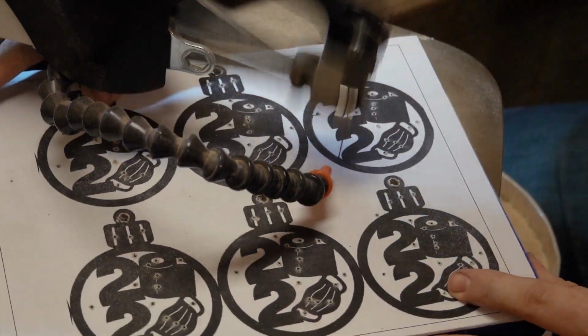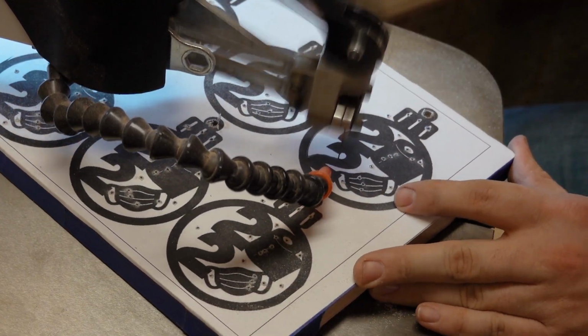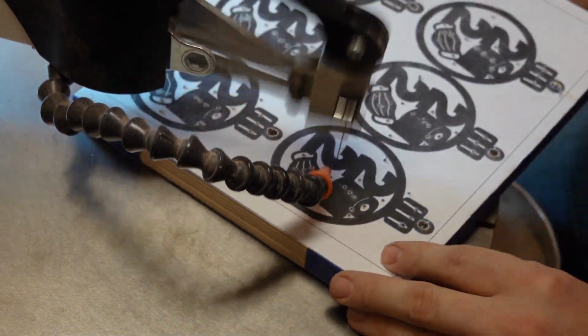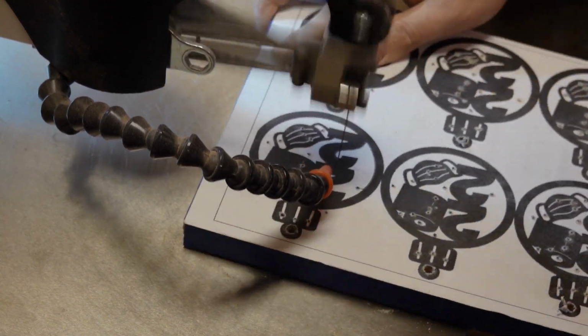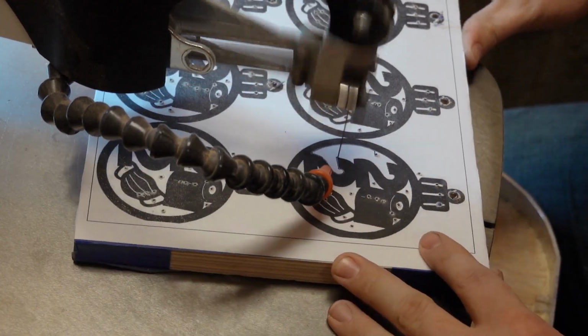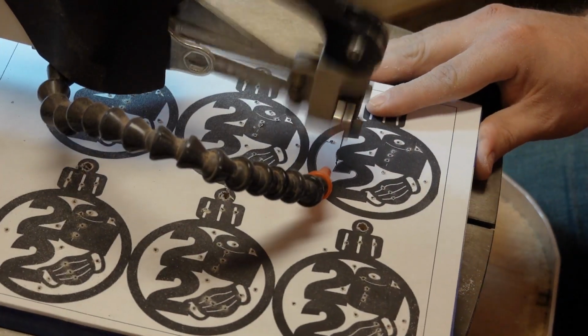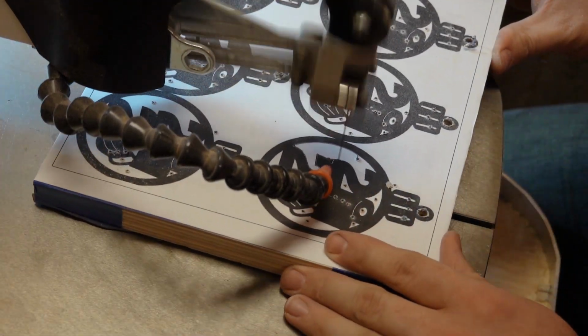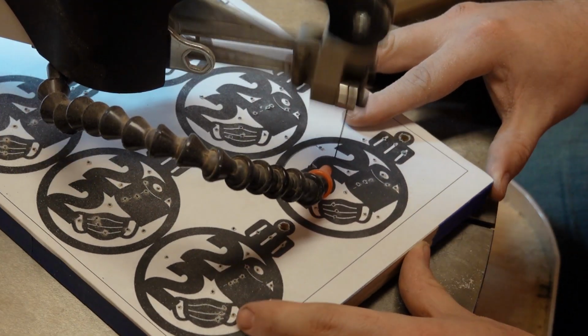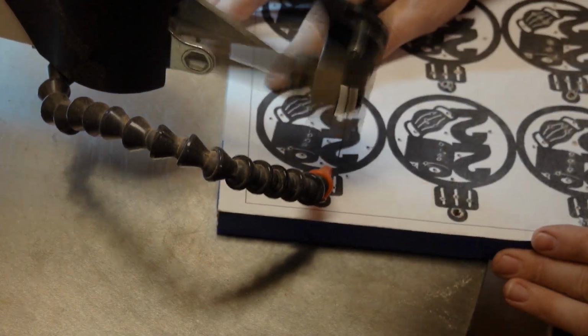Now on to the actual cutting. For this project I'm using a Pegas number 5 skip tooth reverse blade. As I mentioned in my previous video on picking the right scroll saw blades, using a skip tooth blade is important when you get into thicker stock, whether it's stack cutting or thicker hardwoods, because you need to be able to clear the chips out to prevent burning and premature wear on the blade.